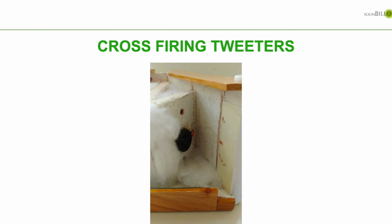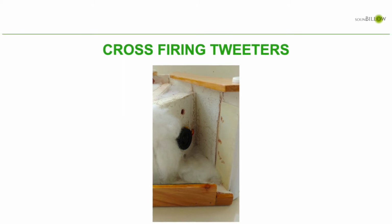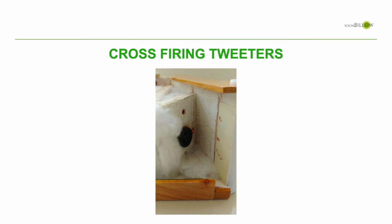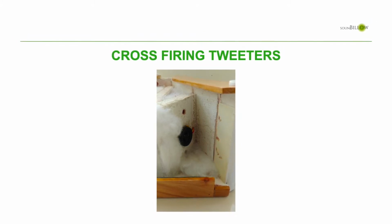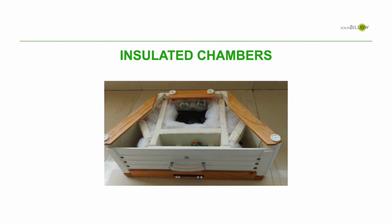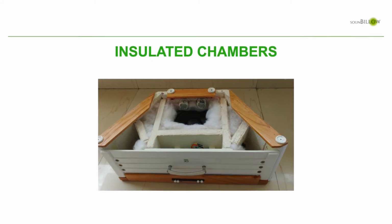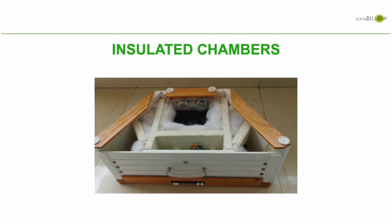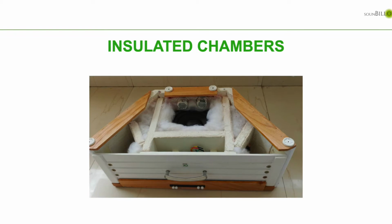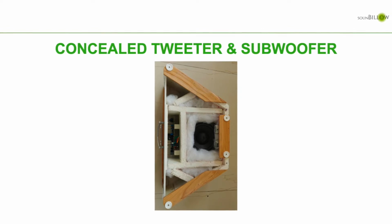The main left and right triangle-shaped room for main speaker seating was further diagonally split into two chambers to make exclusive output for full range and tweeters separately, so that no sound output interference is noticed. Primarily, the speaker output chambers are filled with polywool to avoid echo reflections and unnatural tone tweaking. The tweeter chamber is shaped in such a way that the sound output is delivered as if it is simulated through a linear horn-shaped chamber.